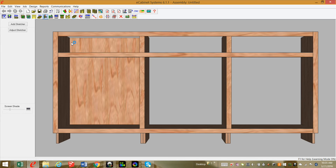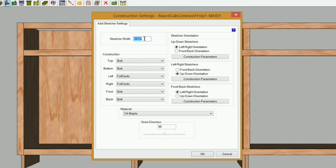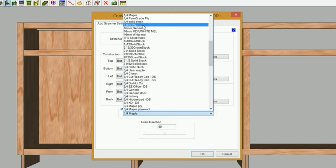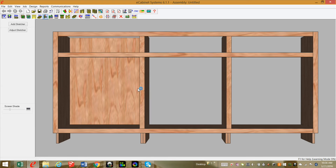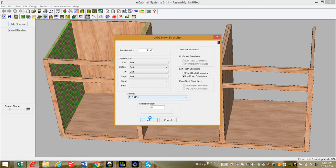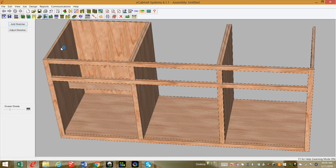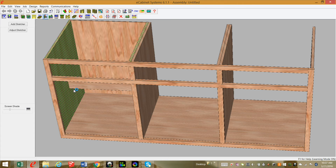The next thing is to get my nailer and my toe kick in. I'll go to construction settings and change the width to four and a half — that's the width of my nailer. The toe kick won't matter because we'll make it adjust automatically. This time I want butt construction. I need to make sure I've got my 11/16 plywood selected and change my grain direction back to zero. Now I can add both stretchers: select my end and my partition, add a stretcher, and OK. There's that one. Let's get the next one in — add a stretcher. So both of them are in there.